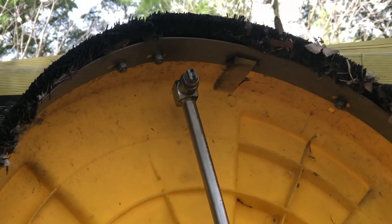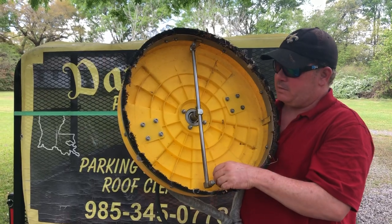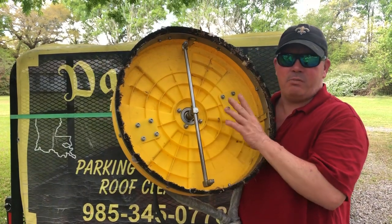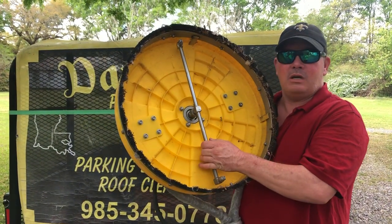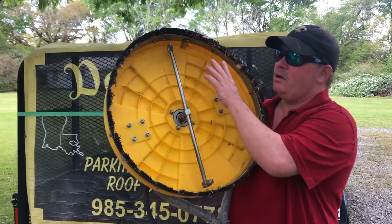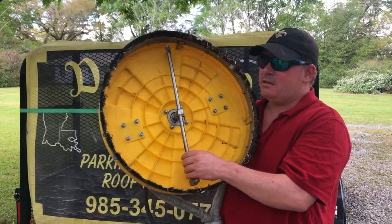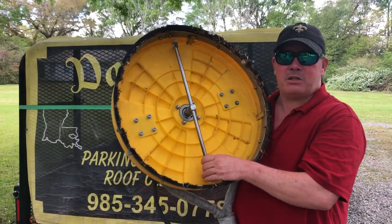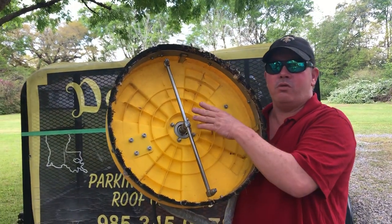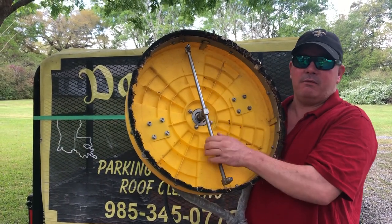So on a project with new concrete, I would swap these surface cleaner tips out and drop in a 25-07 on each one — that way we can surface clean new concrete with that really fine finish. To recap: you want to open up your tips for new concrete, maybe close to doubling the tip size. If you run a 4-gallon-per-minute machine, instead of 02s in your surface cleaner, maybe go to 03 or 04, and open up your tip to a 25-degree spray instead of 15.